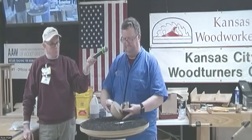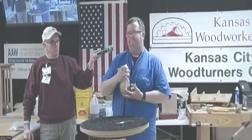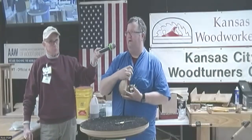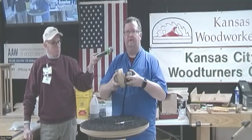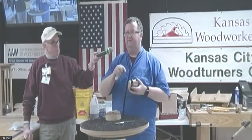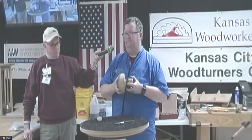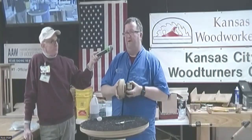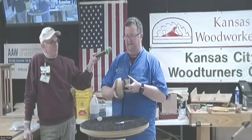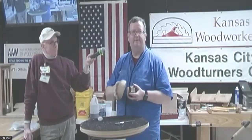Now I'm going to mount it up and, for lack of a better description, make a weld bead — a bead of glue around the whole outside of that waste block. If there are air bubbles, I'm going to take a little screwdriver and knock those air bubbles out. I don't want any air bubbles; I need a good solid glue joint. Then I'm going to take the accelerator and spray that all the way around where it's going to be solid with the CA glue. When I get done and I'm ready to take it off the glue block, I'll use my parting tool to cut that outside bead of glue between here and the edge, and once I do that it's going to be loose enough to use a pry bar skew chisel and just pop it right off.